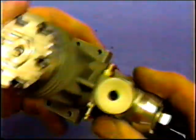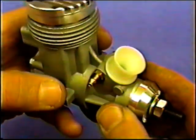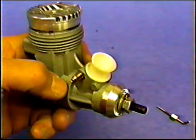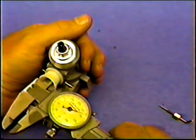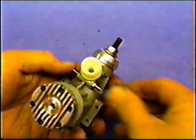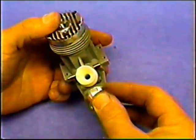No spigot in the venturi. So we're going to start with the stock size, the size that this comes from George, get a little reading on how it is, and then as we want to do some fine-tuning later on, we can open it in small increments. It's 225. Now for a no spigot size, that's really partially opened up already, which is good because I'm sure we're not going to wind up with a smaller one.